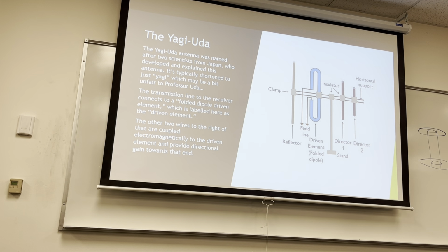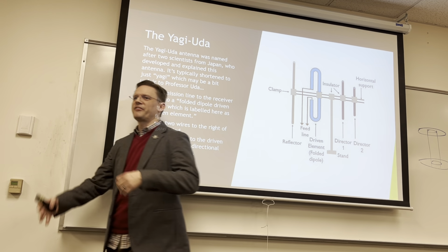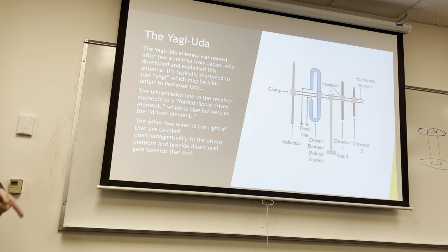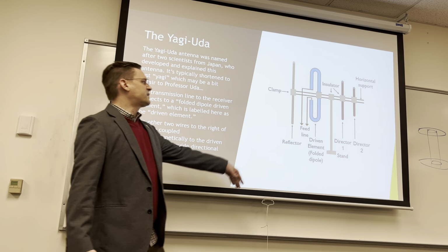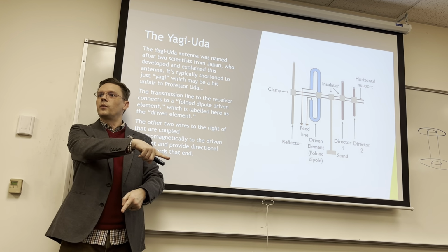What's the function of the dipole? A dipole is just a type of antenna. If this was a straight dipole, it would have a donut-shaped reflection, but that's not very directive. I wanted to point it. How do you point a donut? You don't. So you cut the back of the donut off, fold it over, and put it on the top. Now my donut sort of points one way.